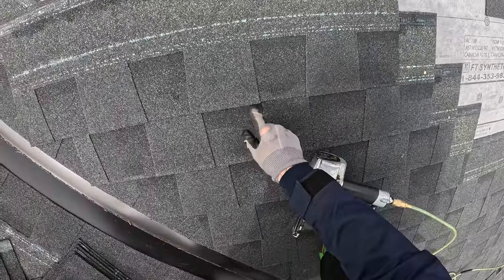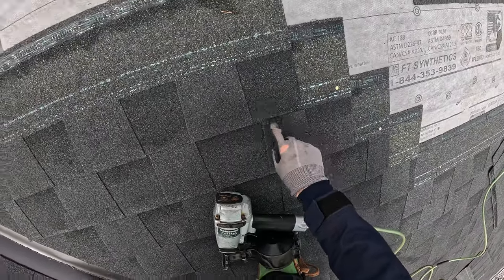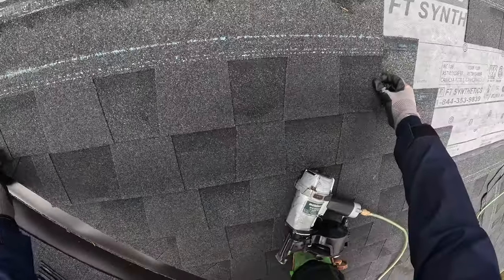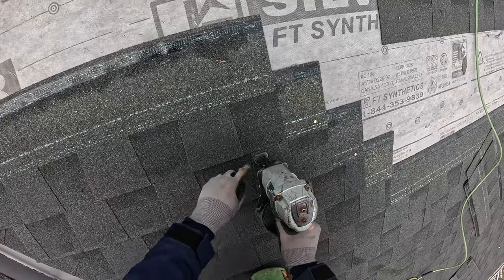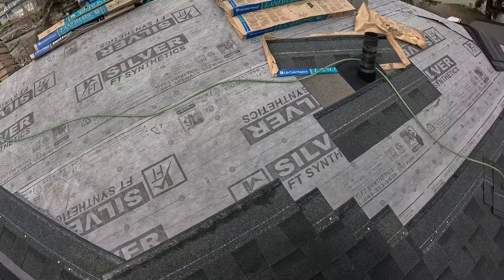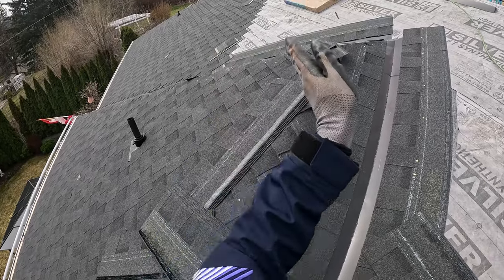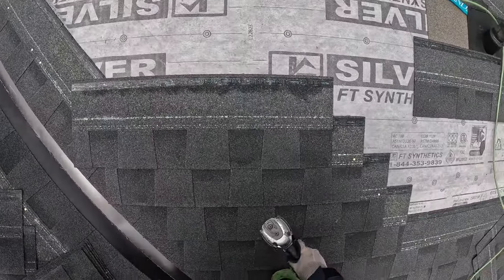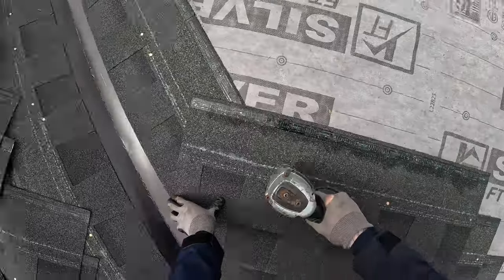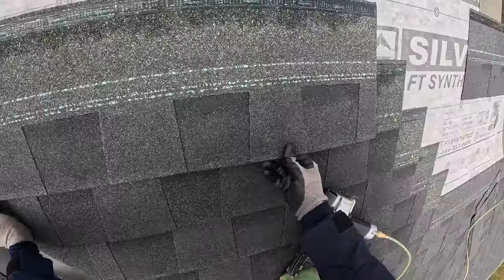I hate when these shingles do this — they manufacture them like this, these are shorter, so when you land you kind of have to leave that up. That's why I don't use the gun anymore to set shingles, because if these are off and you get lots of runs, your whole run could be off half an inch by the time you finish. That's when you get those wavy runs. It's just not an effective way to shingle. I used to shingle like that for pure speed but now I don't bother — I get paid enough to take my time and do it right.